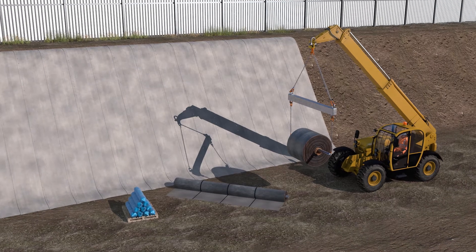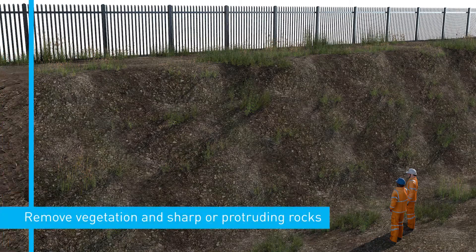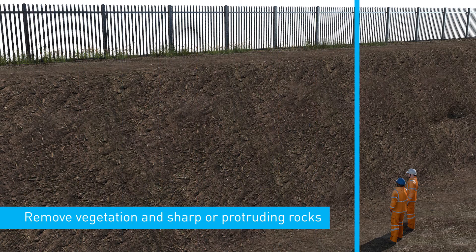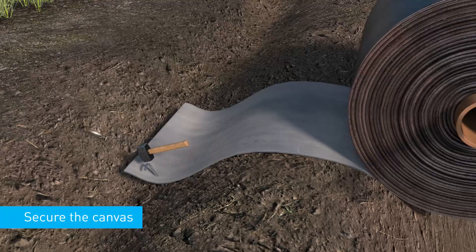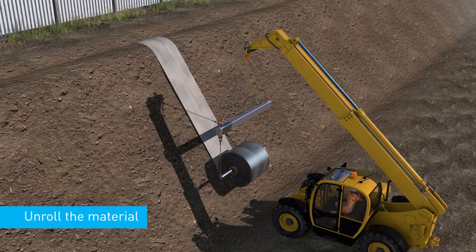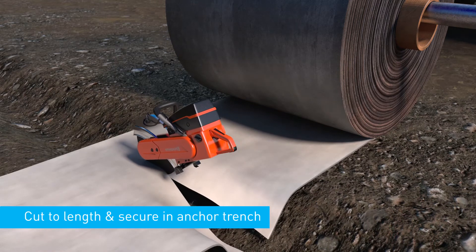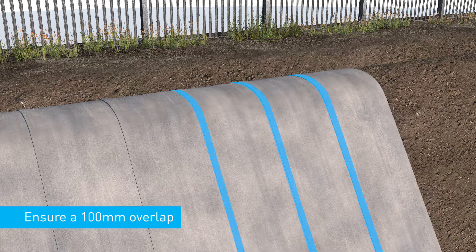This is the procedure for lining a slope with bulk, batched or wide rolls. Prior to installation, remove loose soil, vegetation and protruding rocks and fill any voids. Remove the packaging and secure the concrete canvas in an anchor trench at the crest of the slope. Unroll down the length of the slope in a controlled descent, ensuring the fibrous top surface faces upwards. Cut to length and tuck the concrete canvas into the anchor trench at the toe of the slope. Ensure there is at least a 100 mm overlap and, if along a water course, that the material is lapped in the direction of water flow.